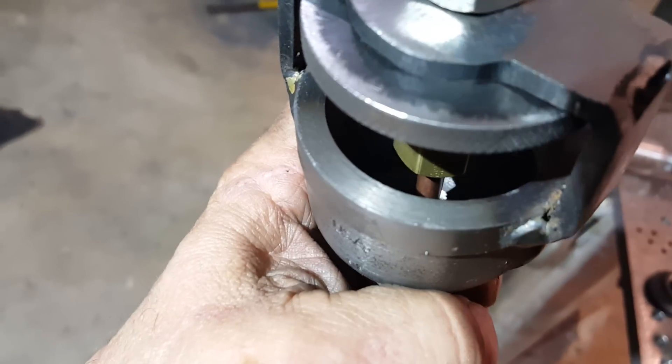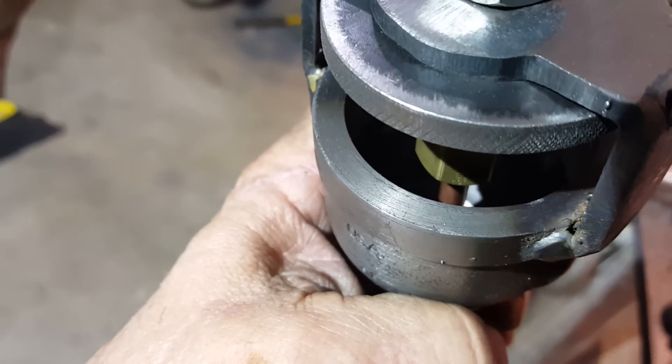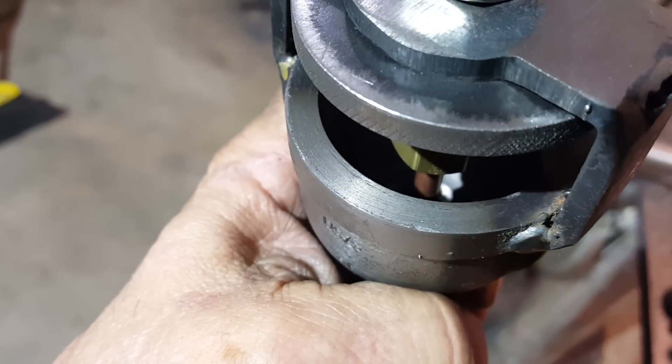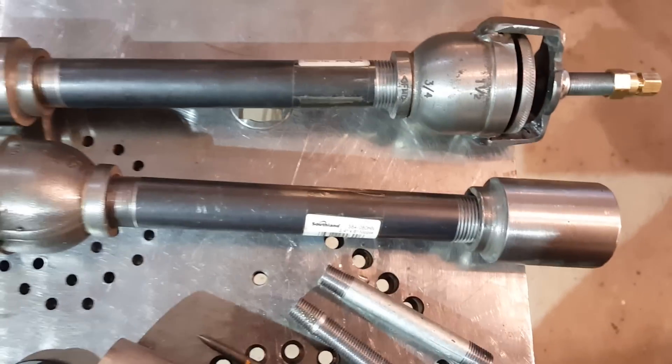Down in the bore you can see the brass cap, which was also chucked up on the lathe on a quarter-inch pipe nipple, then drilled and tapped to quarter-inch 28 threads for the 0.030 MIG tip. That's what I use for this setup — the 0.030 seems to be the most efficient for the amount of airflow and nozzle size.